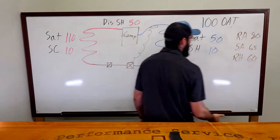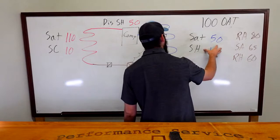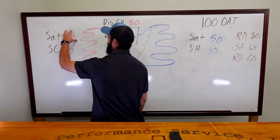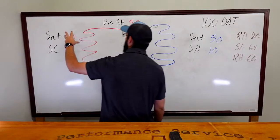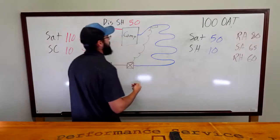You can't properly get the split you're looking for. That's going to raise your humidity, but you're still only moving 10 degrees of superheat, and you've got a low condenser saturation. So if you're moving a whole lot of BTUs at one time, even with an oversized coil, I would expect something more out of the condenser. Maybe not. Maybe it's really that much oversized.